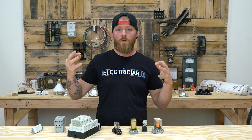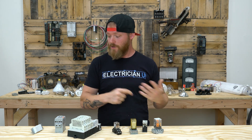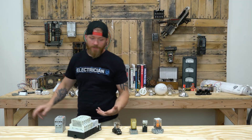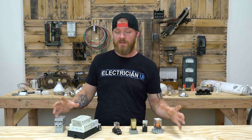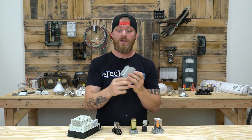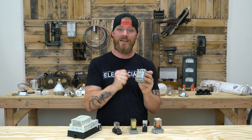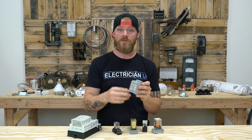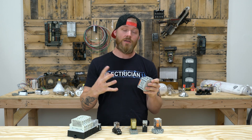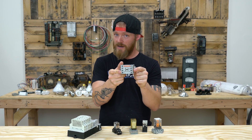The environment where you would need a relay or a contactor is something that you want to be able to control — turning on and off — but you're controlling separate circuits and multiple of them, and you can't do that with a regular switch. What sets a contactor and a relay apart is the function of how that's done. The challenge with a contactor is that a lot of times all of the contacts are normally closed or all of them are normally open — it's basically a way to switch a bunch of circuits that all do the exact same thing. They're all off most of the time and then boom, they're all on, or the reverse.